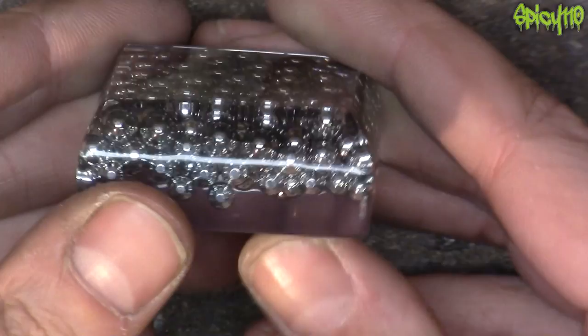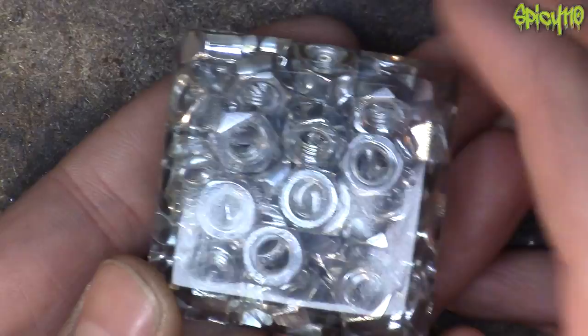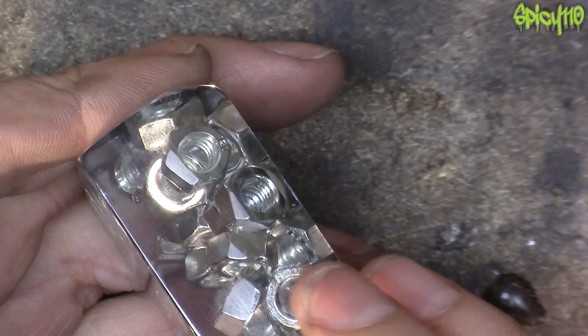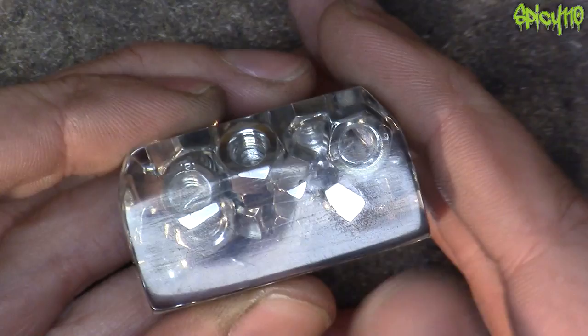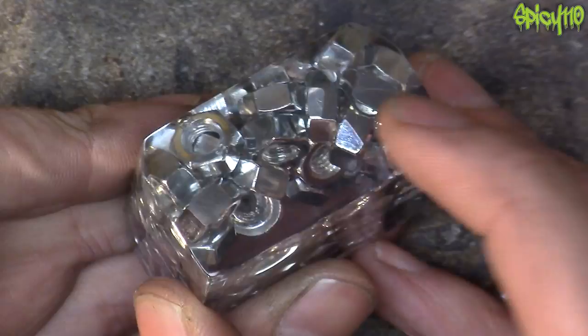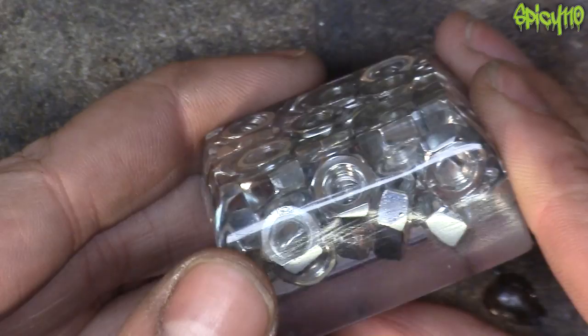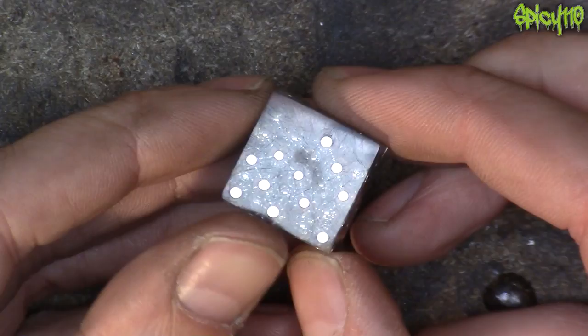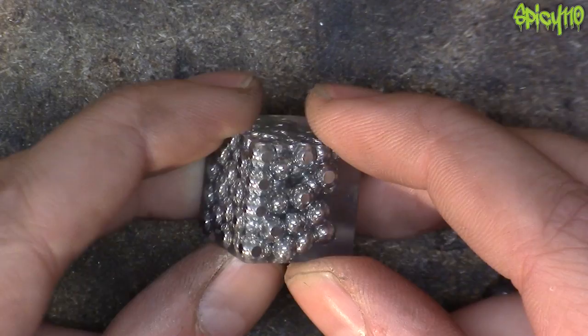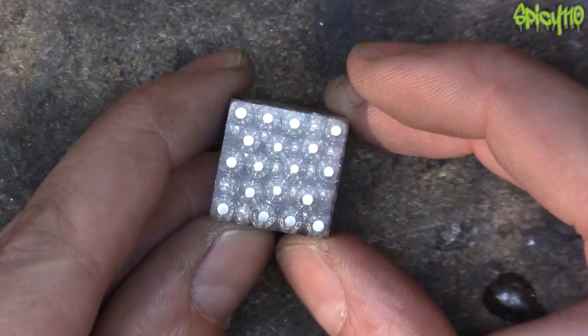The surface isn't quite perfect on this yet. When I was trying this yesterday I was using some 240 grit and then I had nothing else to get me between 240 and 1000. So I've been out and bought some more wet and dry today so I can go back over these again up to 2000 and then polish them - they look pretty cool. I did notice on a couple of them that the thing inside was very close to the edge, and I realised I'd actually sanded through it. But actually you can't feel them - can you see how in the light these little pieces just show through? They're actually the thing inside, it's only on a couple of sides.